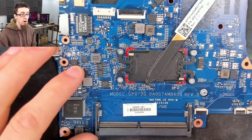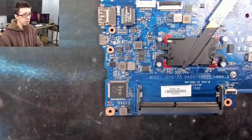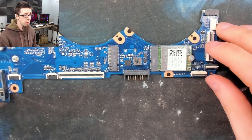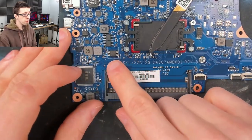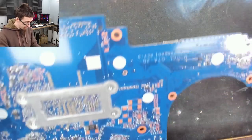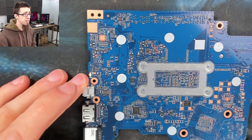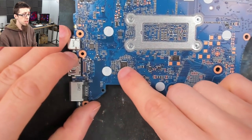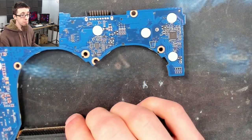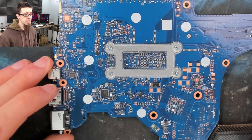I want to know if there is a second BIOS chip anywhere. The answer to that is not a whole lot — there are no other chips on here I could identify as a BIOS chip. No other SOP8 chips. If we turn the board over, there's almost nothing going on — it's just all passives. That looks like a PWM chip but nothing that looks anything like a BIOS chip. So it looks like we have just a single BIOS chip solution for this motherboard, which makes it quite an easy one to deal with.